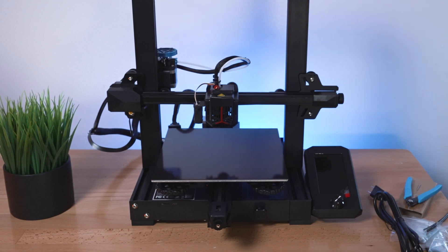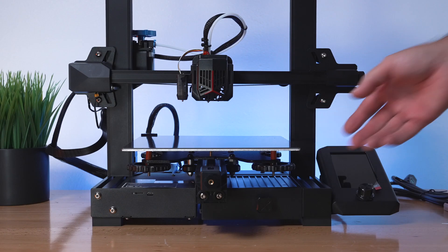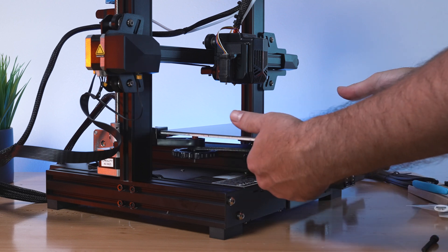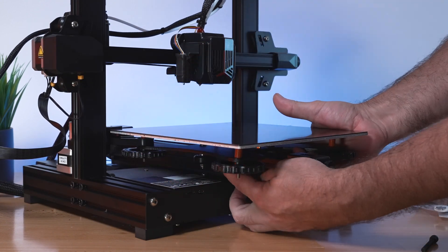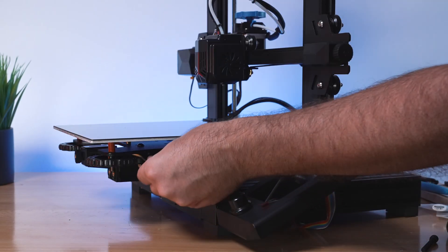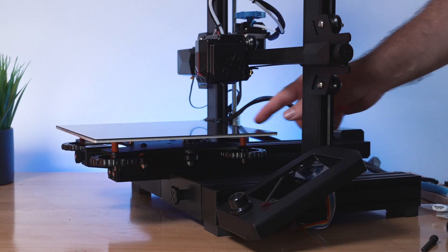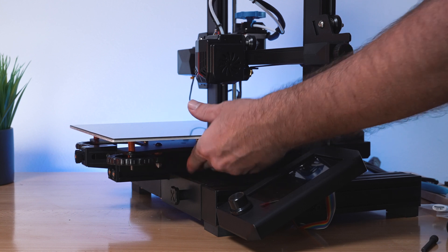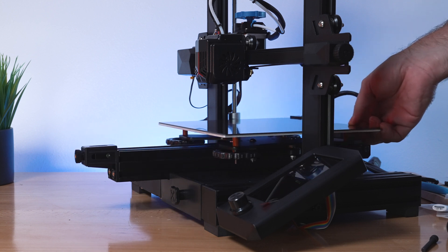Assembly is pretty much finished, but there are important things to do: check rollers and belts to make sure everything runs smooth. On the bed, there are two stationary rollers and two adjustable rollers. Stick your hand in and turn them - you want a really slight drag. Use the included wrench to turn the adjustable eccentric nut to tighten or loosen. You want the bed not to wobble or have any play, but be as loose as possible on the rollers so it rolls smoothly.